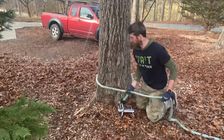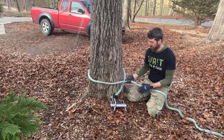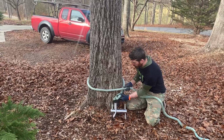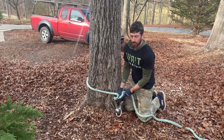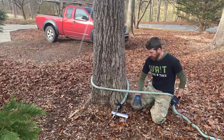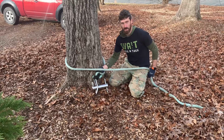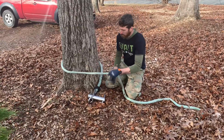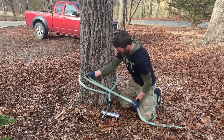And then we're simply going to capture our standing part of our sling here. The standing part of the sling, in this case, becomes the throat of the eye. Now, I want to say, don't go through the eye right here. Don't get confused. Once this deadeye sling is attached to your Porta-wrap, then just consider it like one rope. Pretend that there is no opening here anymore at all. It's just all one rope. I'm going to go underneath, and I'm going to capture it.